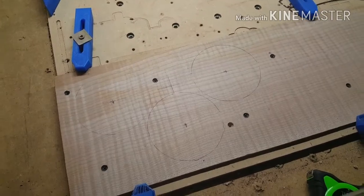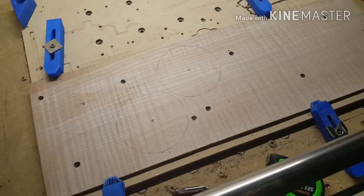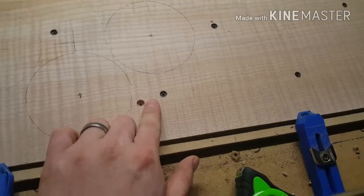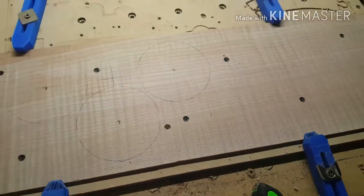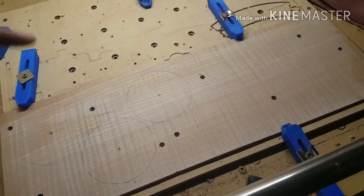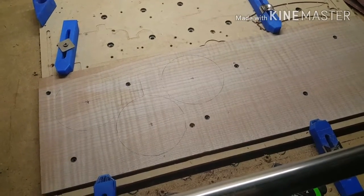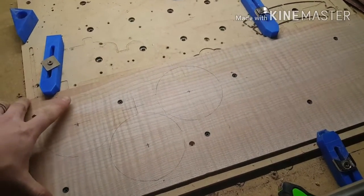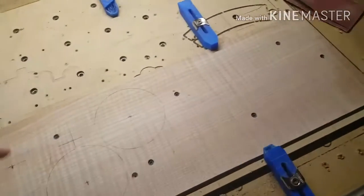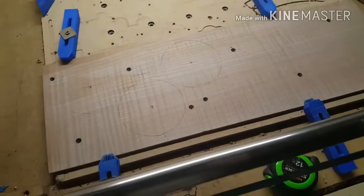So now, since I had a couple of these, I thought, well, shoot, I'll use these. The first thing you can see is there's all these screws in here, and they're all way past depth. See that? That's really important because I want my material to be held down really well. Also what I'm going to end up doing is running a linear pocket, a big square pocket that just flattens this out perfectly to the spindle of the machine.